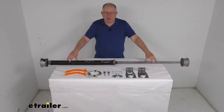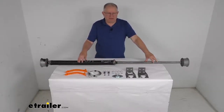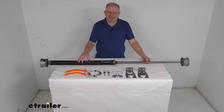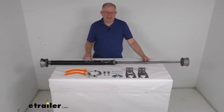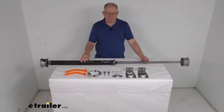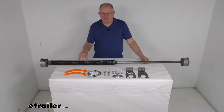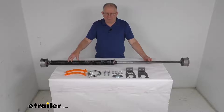This part will replace your old trailer door spring with this heavy-duty conventional ramp door spring. This ramp door spring will let you easily lift and lower the door on your enclosed trailer without risk of injury. It is designed to help take on the weight of that trailer door so that you don't have to. The spring reduces wear, helps prevent damage to the door hinges, and when you do install this, the spring is designed to be mounted one way for proper operation.